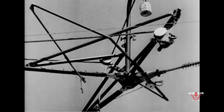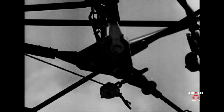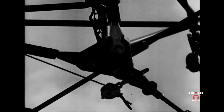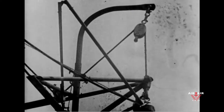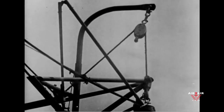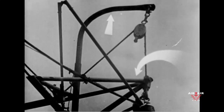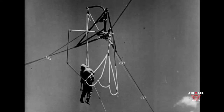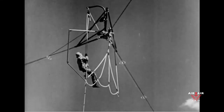It's at this plate that the runway cable is fastened to the two bridle cables. The sockets of the three cables fit snugly into the bridle plate. The triangular bridle plate also holds the two lifting devices, the davit for the man lift, the derrick for the plane lift. The davit fits into a sleeve pipe which is welded into the center of the bridle plate.